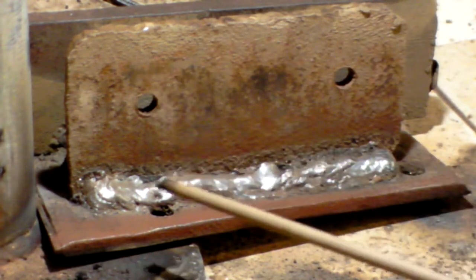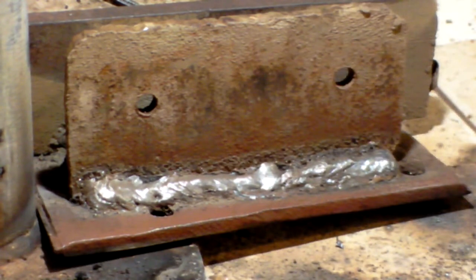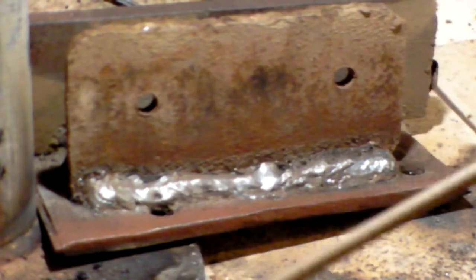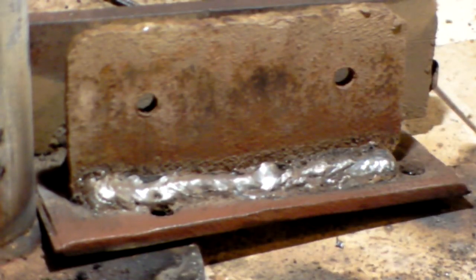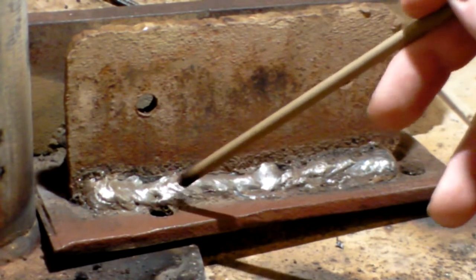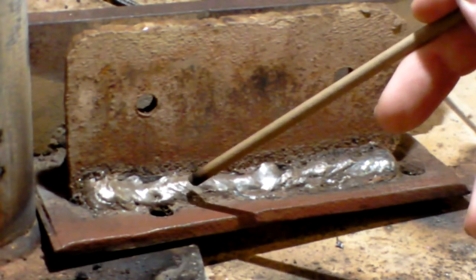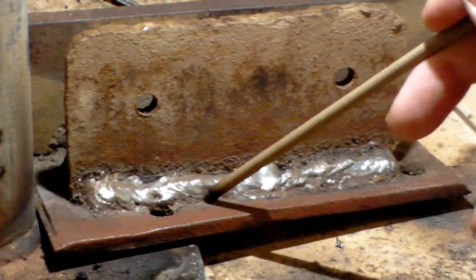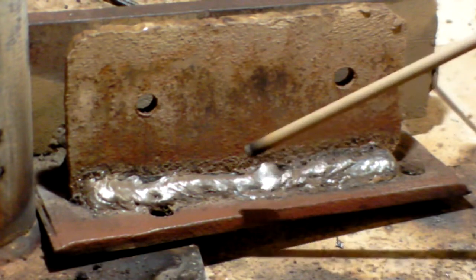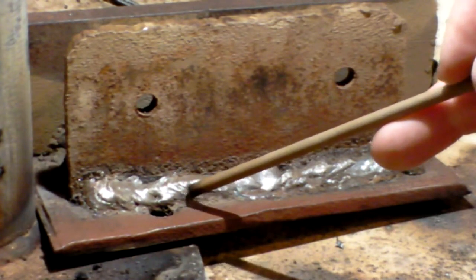One of the reasons it took me a while to get these settings locked in is that this particular machine runs a little bit voltage heavy, which means I have a very liquid puddle. In order to counteract that, I have to keep a very, very short arc length. I cannot let my arc length get long, because the longer your arc length, the more voltage you get in your arc. So I've got to keep this very, very tight. I'll probably have to make some adjustments to the machine, but let's throw a rod in, put on our safety gear, and see if we can run a bead.